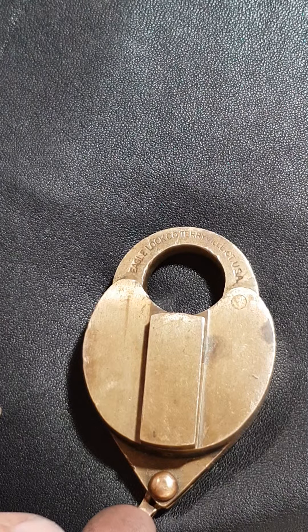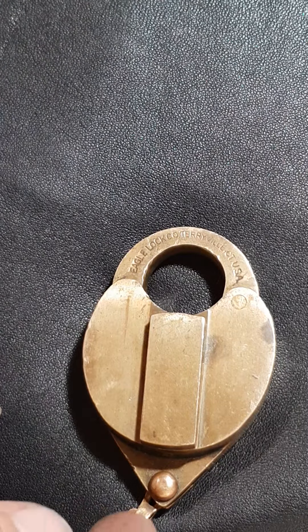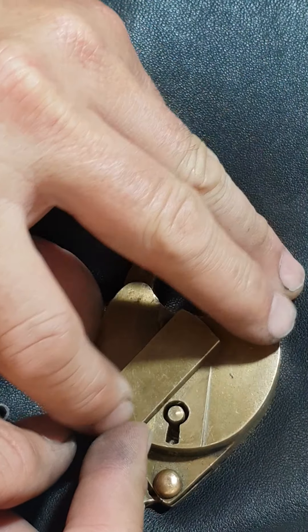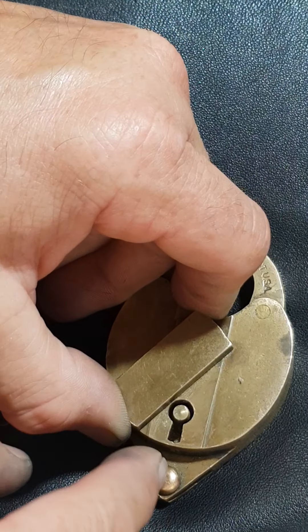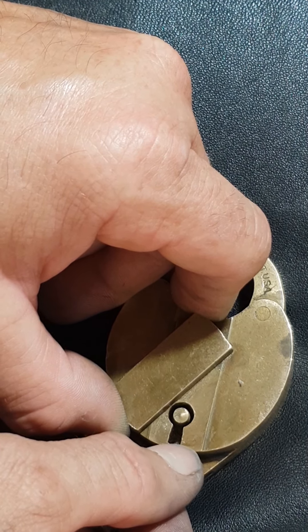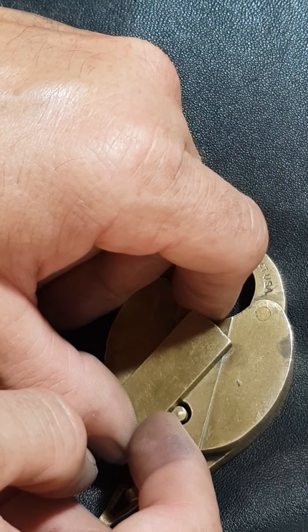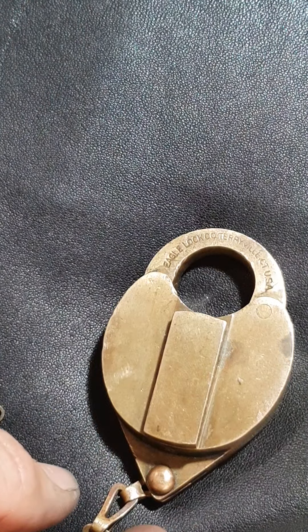The serrated edges really do cause a lot of problems and it's very hard to pick these locks. The tolerances — oh my gosh — you have to be very precise when cutting these keys. You have to make sure that the key has the total bit height that goes right up to the bottom of the keyway. Anything shallower than that, you're not going to get enough over-lifting to lift some of the tumblers.